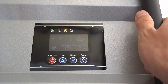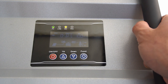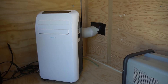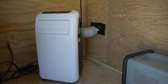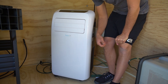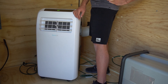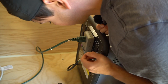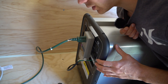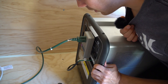After charging for two days we're at 100% battery — it's probably balancing or just topping off that final absorption. Let's do a capacity test. We have our trusty air conditioner, so let's hook it up. Because this is a low frequency inverter we should be able to run like three of these. The compressor's on and the fan's on high — we're pulling 950 watts continuous, which is almost a 0.2C rate for this battery size, making it perfect for a capacity test. We'll come back in a few hours.